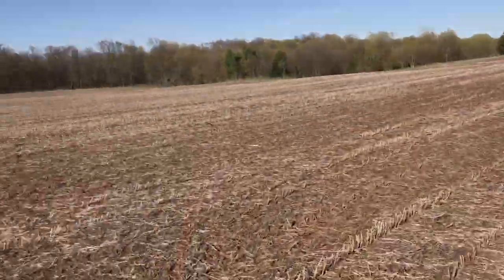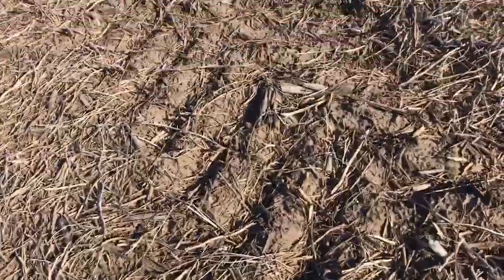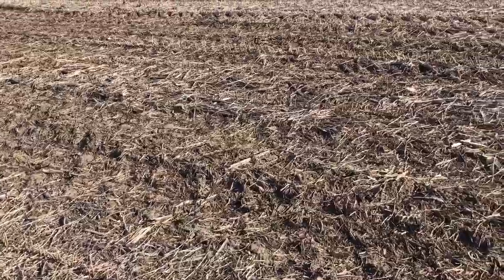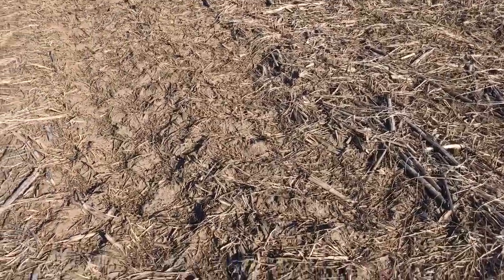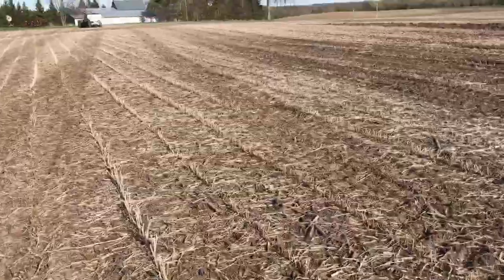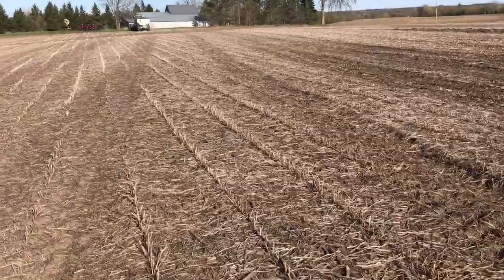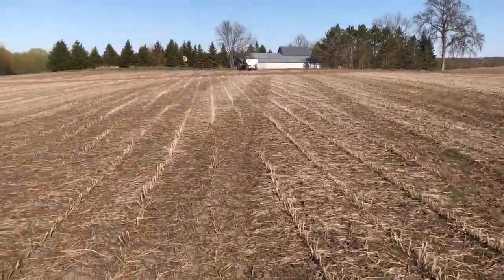What I'm doing now is just looking from the pass he made. Let's see if I can get a light here — there's a couple here and there. It's a 50-foot spread on the spreader. I think he set the light bar for 45 feet. So there's the spread from this first pass. It's a little scarce here, but we didn't maintain the speed — we maintain a single speed and the feed coming out of the spreader maintains itself too. So we're probably in pretty good shape in terms of that.